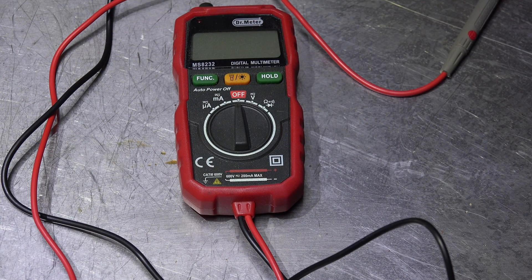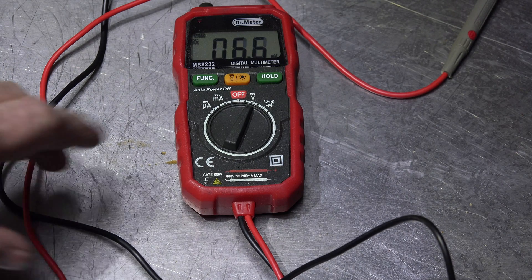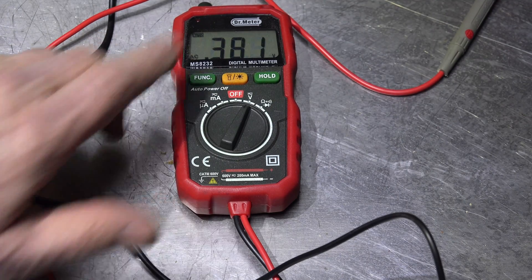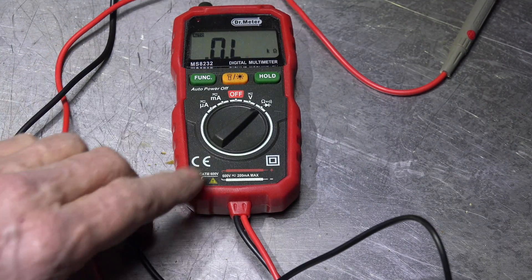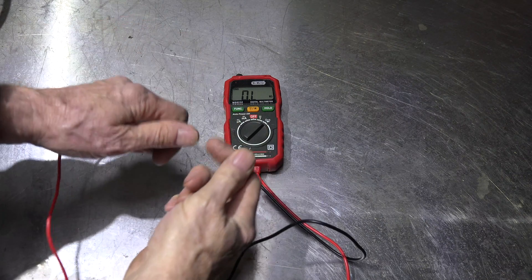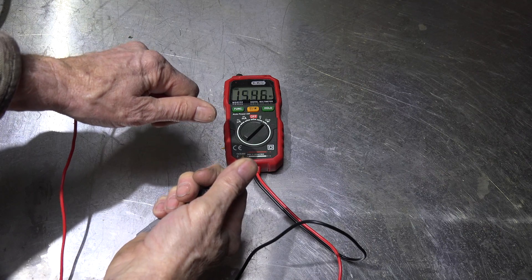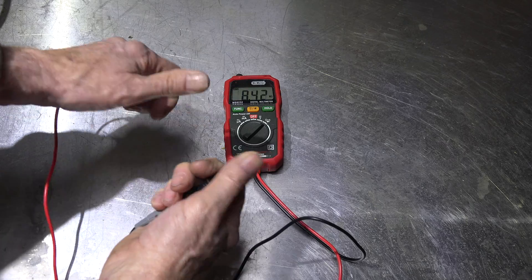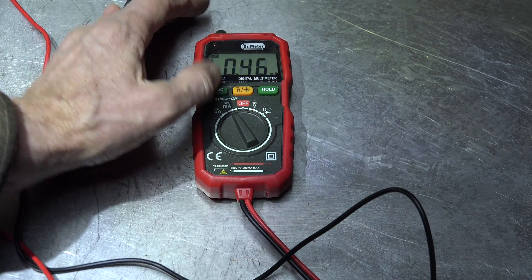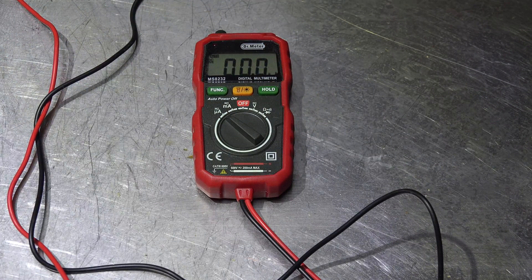What can this meter do? It actually does quite a bit. It does volts from millivolts up to higher voltage — I think it goes to 600. It defaults to DC first, which is usually not best for HVAC, but you push the function button and it'll go to AC. The ohms is actually a mega ohm meter — putting it across my hands, it reads mega ohms, though whether it's accurate I don't know. It'll do milliamps DC or AC. It also does micro amps, and I'm going to test that in a furnace before I'm done.